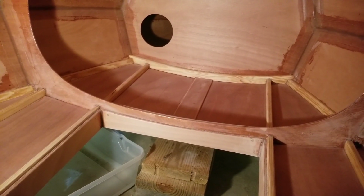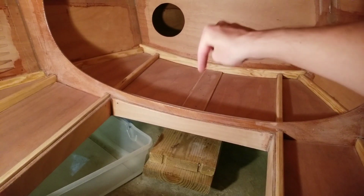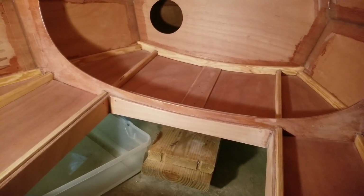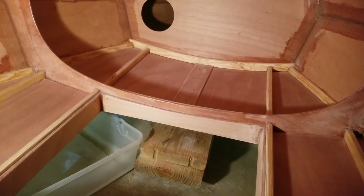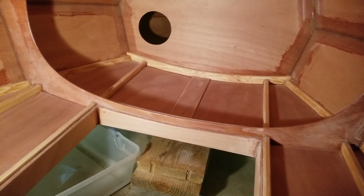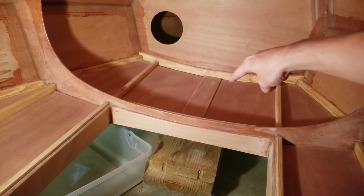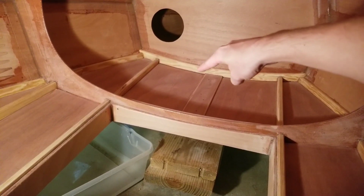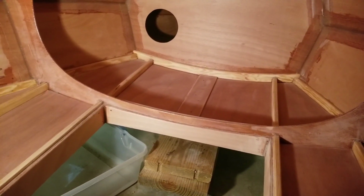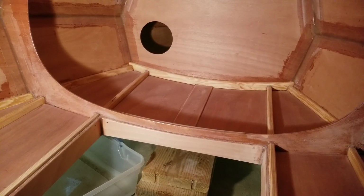It's just good to have extra thickness there, especially on blocks where you have load that's pulling straight out of the deck. You don't want your halyard block to blow out of the deck. So fender washers and backing plates are the norm. And also, if you can screw into the deck beam itself, with a long screw, that has just as much or almost as much strength probably as a through bolt in that situation.